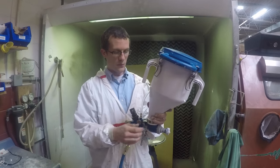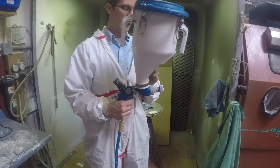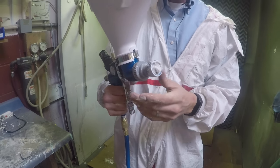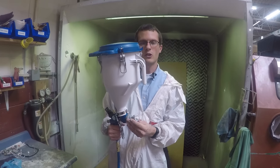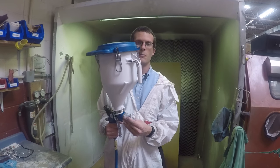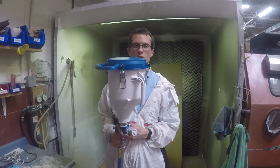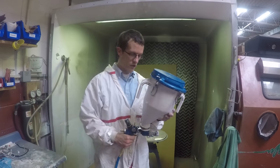The unit is pretty simple — it has a simple band that tightens down here. It comes with two kinds of tips: a wide angle tip as well as more of a circular tip. If you're from a traditional school of texture spraying, you're most likely used to a round spray pattern. The wide angle tip allows you to mimic more of a natural spray gun type spray, so if you're used to spraying paint and looking to do some texture work, that makes your life a little easier.